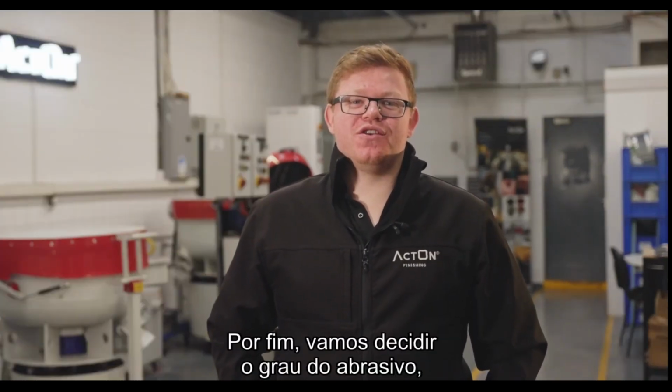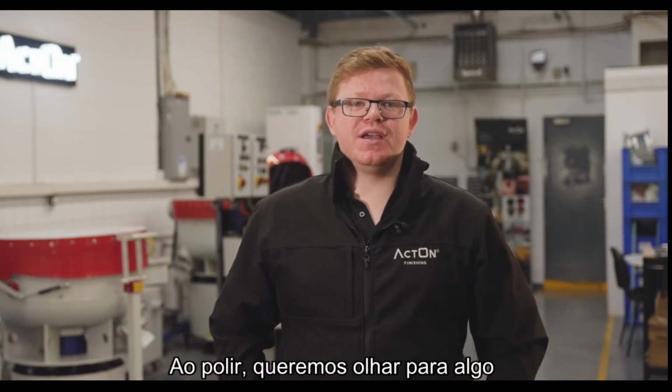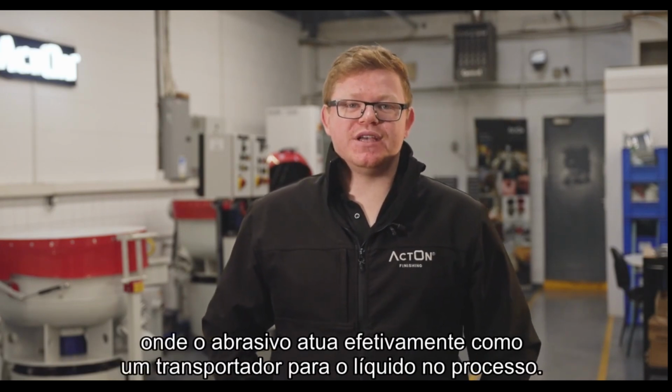Finally, we will decide on the grade of media, which is mainly looking at the amount of abrasive that we want to use in the process. When polishing, we want to look at something with very little abrasive, where the media effectively acts as a carrier for the liquid compound in the process.